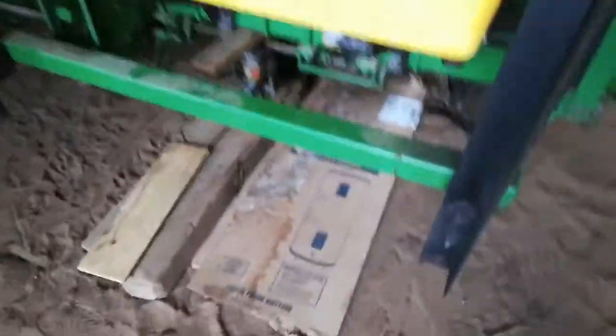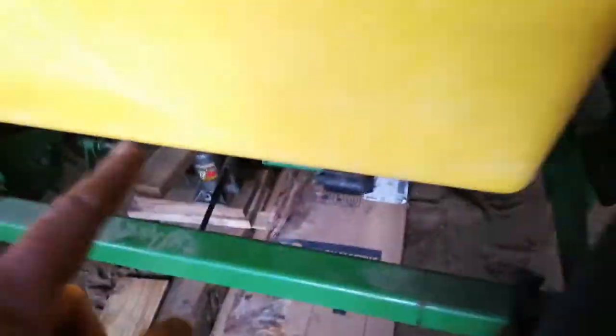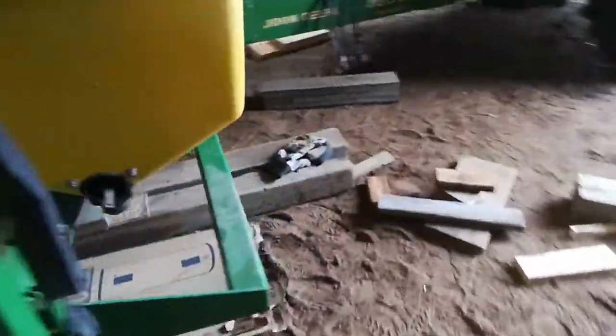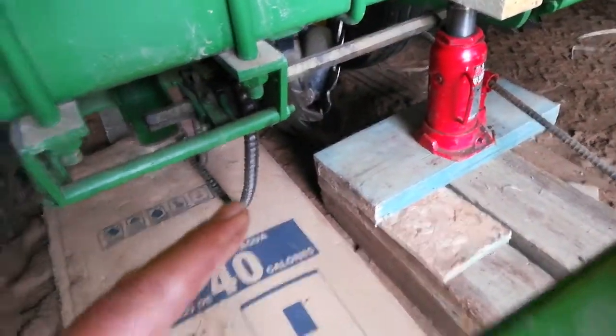What I had to do was lower the planter to the ground. I've got some cribbing and bottle jacks under the toolbar, which is a big — I think it's an eight by eight steel tube, the structural part — and it's also attached to the tractor. I've got one on this side and one on the other side as well. There's the bottle jack, and there's the drive chain, which gives you a hint that I managed to get one of them off.